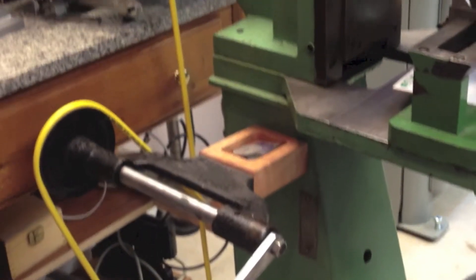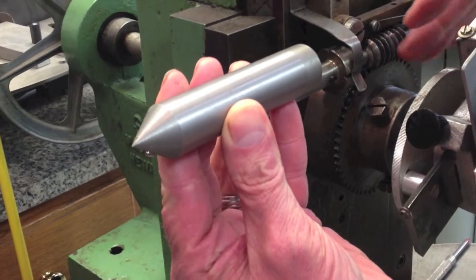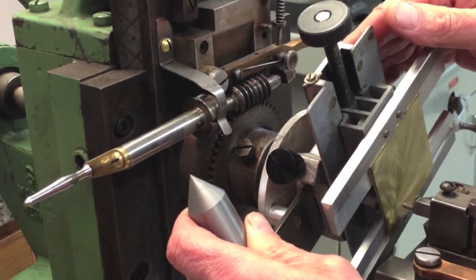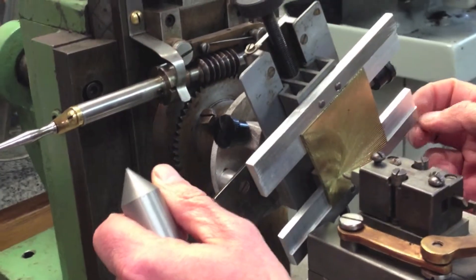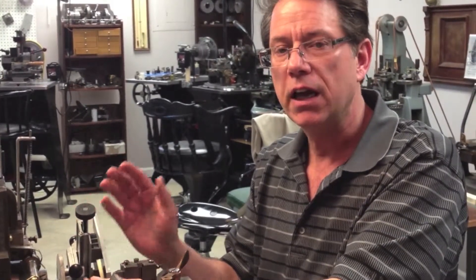There's not a lot of these machines around and they're not very valuable. I did add one piece of tooling to it — a center that is seven-eighths and goes in the center of the spindle. That way I can find center very quickly with my diamond or my cutter, then pull it out and mount my piece, so I know everything is perfect. Well, that's about it for the bordering machine. It's an easy machine to learn — there's not an easier machine in an engine turning shop to run. If you take some ideas out of the Carl Fabergé book you'll have a lot of fun with a machine like this. Thanks, and come back to the Rose Engine Shop.